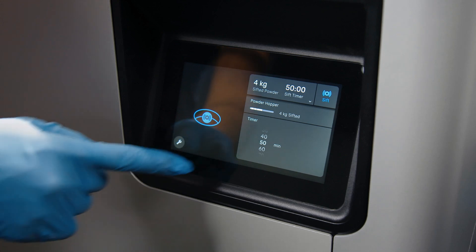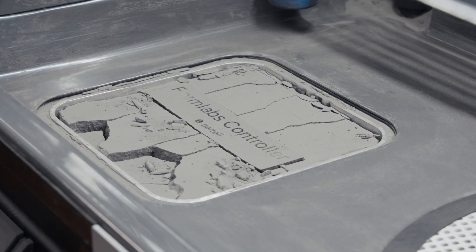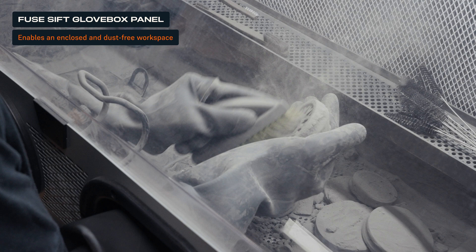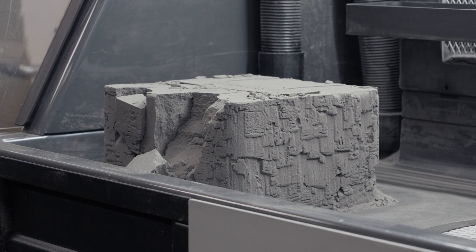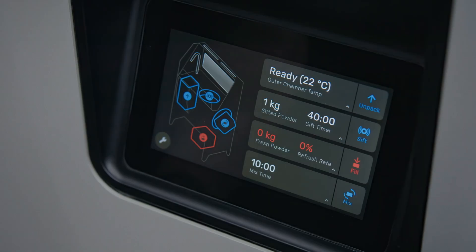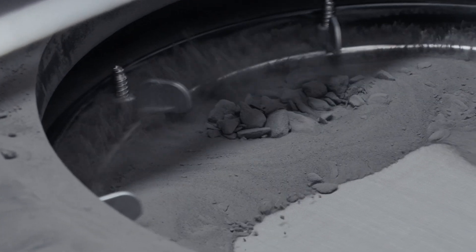The Fuse Sift features both a touchscreen and physical controls. To begin, turn on the light — this activates the negative air pressure system, which keeps powder from escaping the workbench and enables open access and easy cleanup. For a fully sealed workspace, enhance part extraction with the Fuse Sift glove box, a simple add-on that contains dust and supports an efficient, ergonomic workflow. To extract your printed parts, raise the print bed. SLS printed parts are surrounded by un-sintered powder, which we call the powder cake. Push the powder cake to the center of the workspace and activate the sifter. As you gently break away loose powder from your parts, the sifter vibrates to separate the un-sintered powder into the hopper below, where it's stored for future prints.